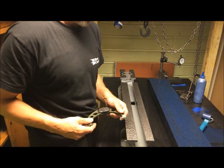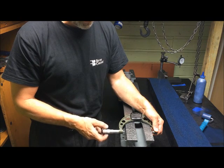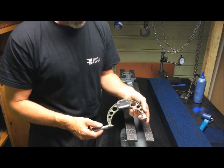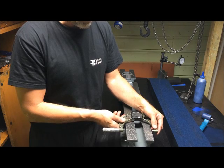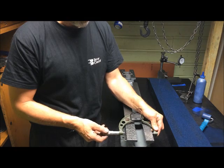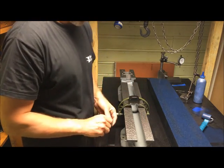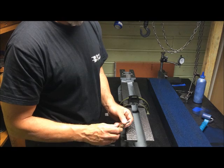I'm not sure everyone noticed — of course you did. But I had a difficulty measuring consistently with the micrometer across like this. This is not new, but I had a set of new ones I also used. I don't want to grind the tip of this. The flats here against the flats there — I find it a little bit difficult to get consistent results and get the feel of it. That's my problem really, but that's where I thought maybe we could introduce a worn-out milling cutter which is damaged. But of course, I'm the only one that damages them, aren't I?